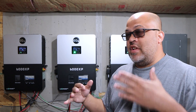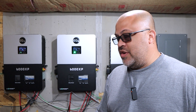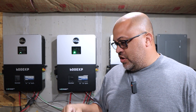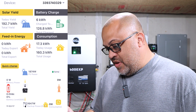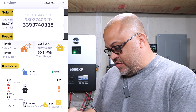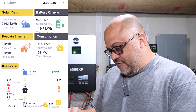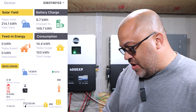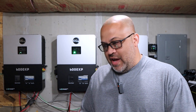Because the arrays aren't even, I'm not sure if it's going to completely work when I try to run the whole house, but I'm going to turn the whole house on and see what happens. Right now I've got my whole house running with no battery connection, just solar coming in. Let's pull up the app on the phone. We got 1,874 watts coming in on one inverter, 1,647 going out. That's what it says. 1,674 coming in on another one, and 1,436 on another one.